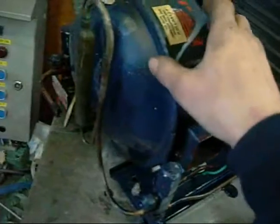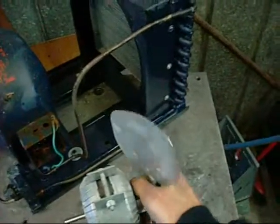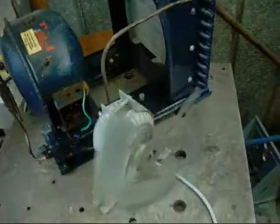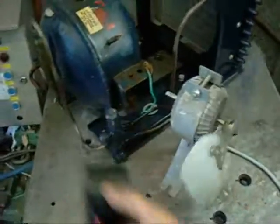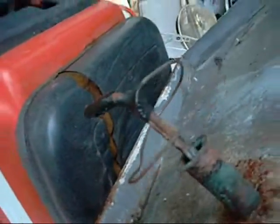There's nothing wrong with the compressor — it was all working but it just had a leak. Oh, and a dead fan motor too that kept tripping the earth leakage breaker, but I found a good fan motor from another dead unit. The original relay is fine, but I took all that out before I washed it and gave it another clean. The oil's pretty good; there's just remnants of old blue paint on the fins. That's the old evaporator. I got rid of the mouldy old chipboard that was just rusting everything out. Capillary tube and everything sealed off.